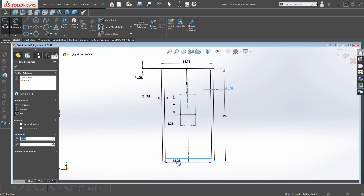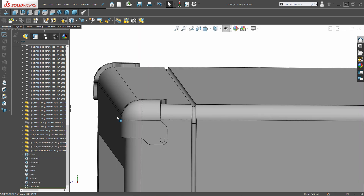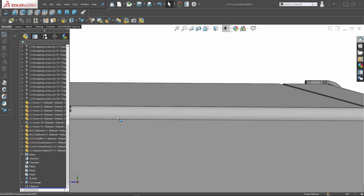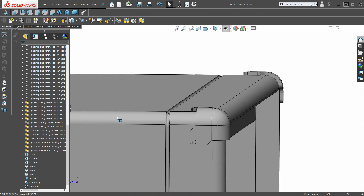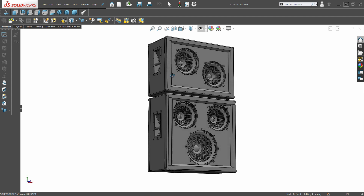This model couldn't be easier to set up in CAD. The cabinets will be constructed using mostly simple box joints, so the meat of the CAD work is mostly a series of extruded rectangles. The most complicated modeling was for the pre-made components like speakers, handles, and hardware. Once all the basics are covered and the assembly looks good, all the post-CNC by-hand detailing like round-overs and B-channels can be mocked up as assembly-level features in SolidWorks. This wasn't a 100% necessary step, but never a bad idea to cover as many details as you can in the plan. It gives a much better preview of the finished product and helps avoid unexpected surprises when moving from CNC to handheld power tools. Loads of little tweaks were made after seeing an accurate representation of what the cabs would look like in 3D.